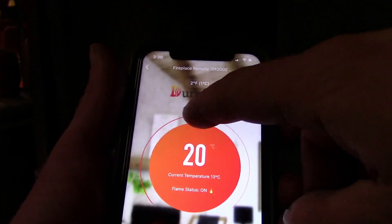I'm going to plug everything into the control box — you plug in your temperature sensor, and the instructions say to keep that away from your fireplace since you want it to measure the temperature of your room, not the fireplace. And of course, plug in your power source. It paired with my device really easily. It starts out in Celsius — I'm more familiar with Fahrenheit — but I cranked up the temperature and instantly it started sparking, which is a good sign. The gas is not turned on yet, so it won't get any gas flow. The first time you use it with gas on, it will take a few seconds for the gas pressure to push out all the air inside the pilot line, and once it does, it should fire right up.